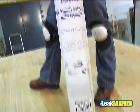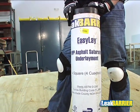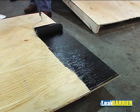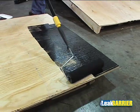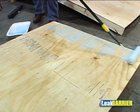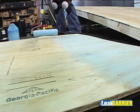The self-adhering membrane may be applied to an acceptable mechanically attached base sheet, such as a TARCO Easy Lay Base Sheet, or any of the acceptable substrates. In direct-to-deck applications of self-adhering underlayment, one may apply an ASTM D41 asphalt primer, a water-based acrylic primer, or a water-based polymer modified primer to the roof deck to enhance adhesion.